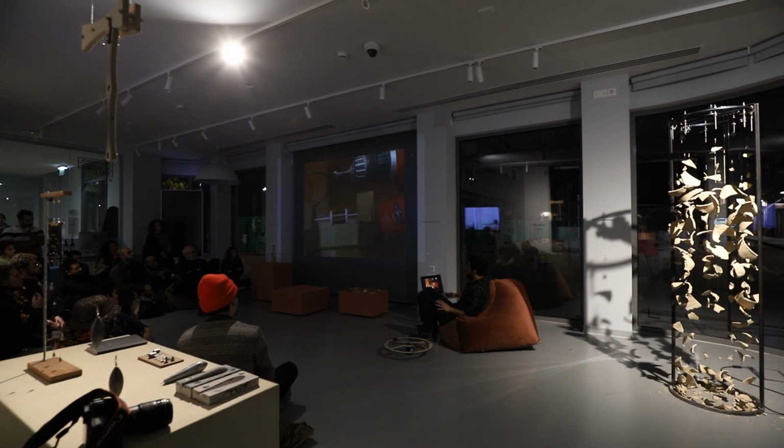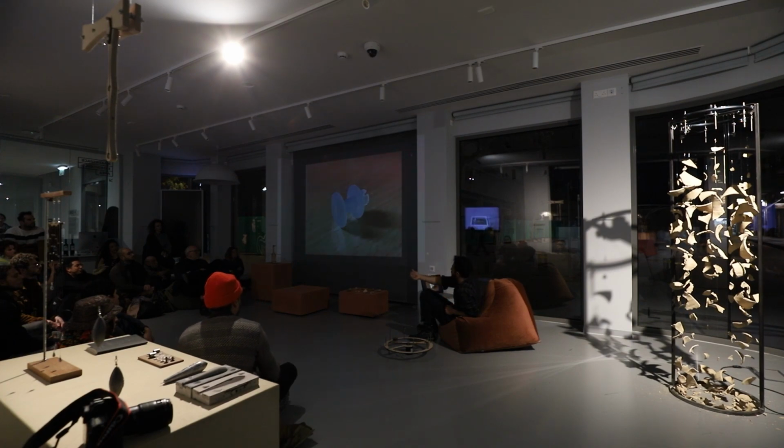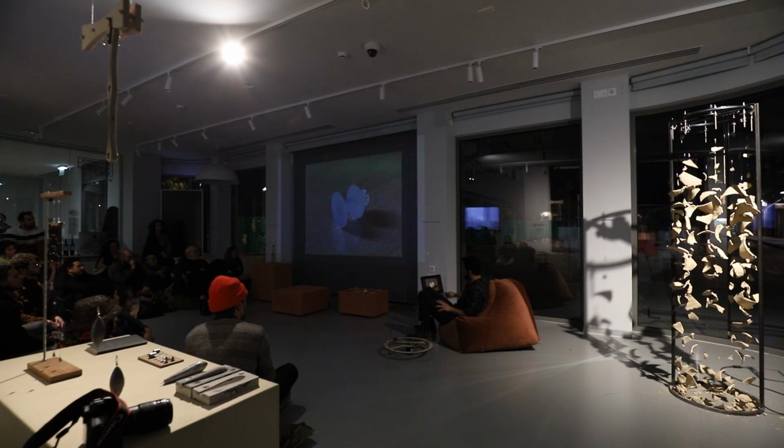So knowing that I will still be working with electromagnets for quite some time now, I designed my own case for them. So this is all in one object. You can just take this and place an iron core in the middle. And again, place this on a drill and do the windings. So I'm still going to make my own coils, but this, at least, is going to save me some time.